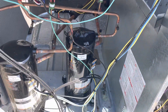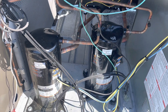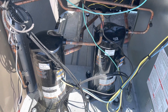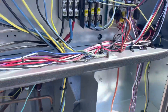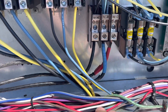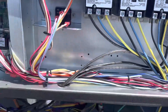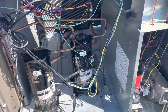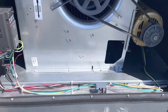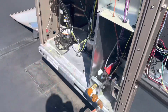Very interesting. I have a VFD-driven blower motor, and this VFD is programmed to turn in one direction no matter what the polarity is. That's why my blower was turning in the right direction, and my compressors and fan motor were not. My compressors were in overload, so I'm going to have to cool them down and get them started back up. I've got the polarity switched — the one with the red tape and the blue tape, I switched those two around, and I put my condenser motor wires back the way they were. When they started it up in heating mode it didn't show the problem because the VFD was programmed to run in one direction. Tricky stuff.